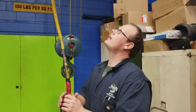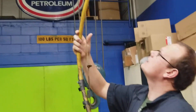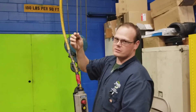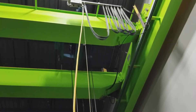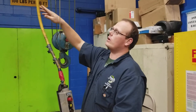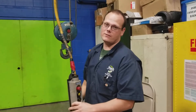Another thing to think about is your safety wires. This is an actual wire that hangs our switch — this switch controls our mechanism, our overhead crane. If you look, this switch is dangling from this wire rope, a little small wire line. We've got our power cable that operates this switch connected to the cable. This needs to also be connected to this line and secured in some fashion, so that when you do have a load it doesn't catch it. That's another defect.